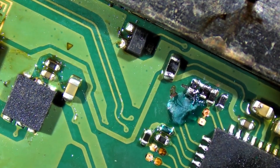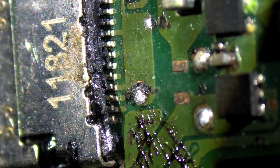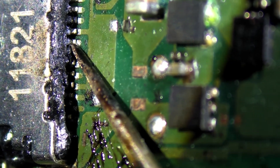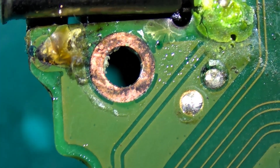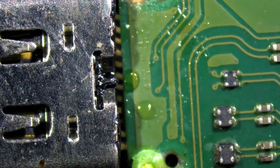It's going to be time to check out the USB-C port on here now. Looks like we got some burnt plastic, and those pins don't look like they're secured very well. Let's take a poke at those — oof, it moves. None of these pins are solid at all. More of that corroded-looking stuff there, but at least it's just on the pads for the port. We're going to be putting a new one on, so hopefully the damage will be minimal.